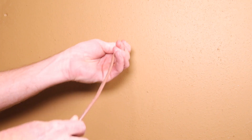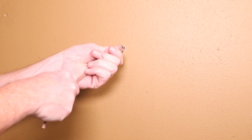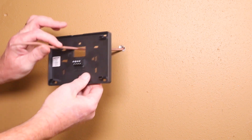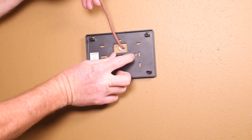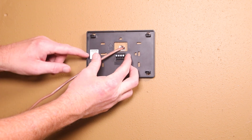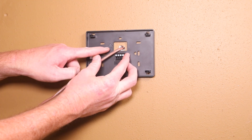A single 4-wire cable installation is shown here, but if possible, we recommend two 2-wire cables being used — one a 2-wire 18-gauge STAT cable for voltage wiring, and the other a 2-wire 18-gauge SHIELD cable for the communication wiring.